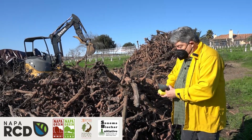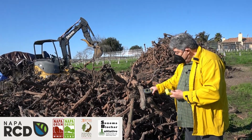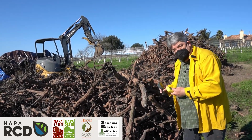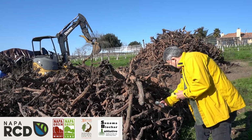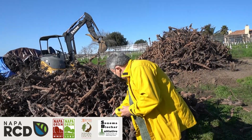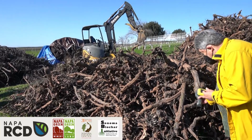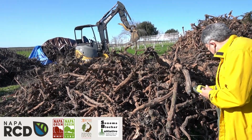So what you would do is you would come in with this one, which is really cool. You just kind of touch it down to the wood, and it shows that it's 4% moisture, which is fantastic. Again, down here, that's 9%. One over here, 9%. You can do the edges, but it's not as critical.